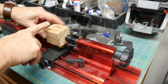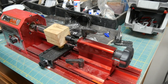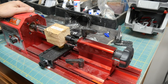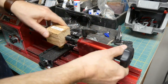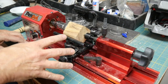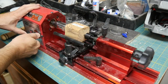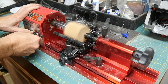Very often people will cut off the corners of these blocks of wood before they start turning them. I find it's easier to just take it to a sander and sand off the corners. The reason you do that is so it doesn't catch when you start carving. I've remounted my block of olive wood in my lathe, turned it by hand to make sure it appears stable, and I'll have the lathe all the way on the slowest speed.